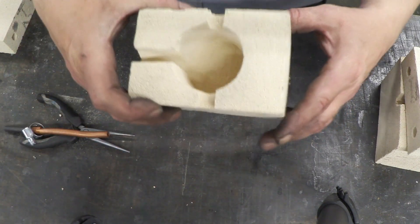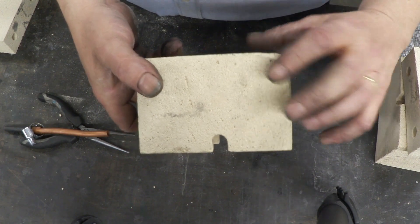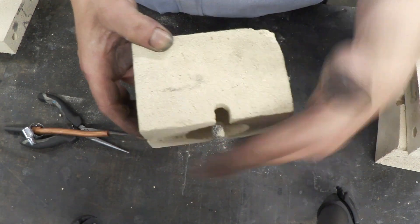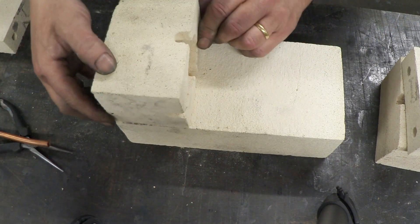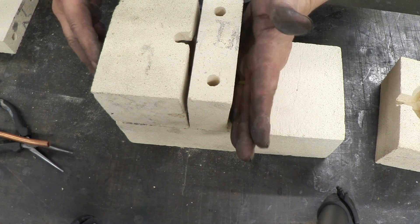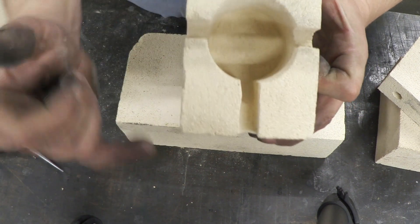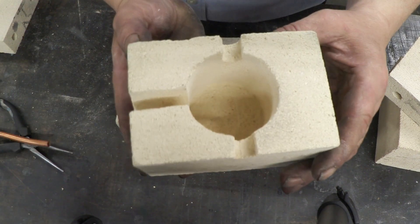Now have a closer look at the furnace. It's a normal fire brick from eBay — three inches, or 75 millimeters, on the end. The brick was cut in half, one and a half inches were cut off, and the centre was taken out using a 50mm hole saw, plus two 10mm holes drilled straight through and one at a 45-degree angle. That's how the furnace body was made.